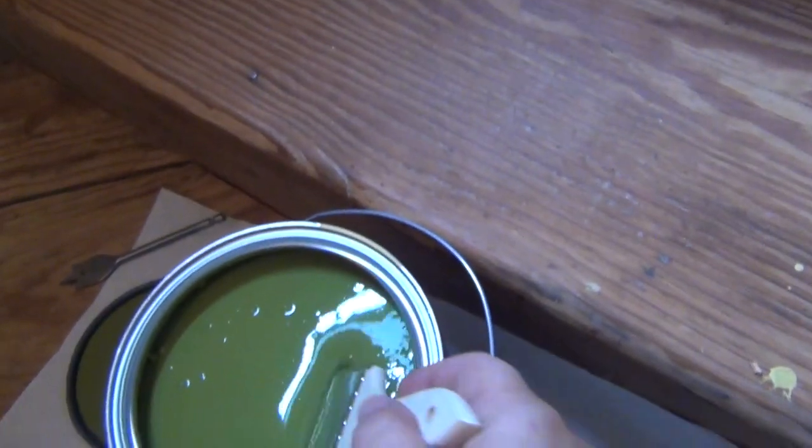The brush is not that great — I think I have to go clean my other brush. I'm definitely going to have to do several coats of this; for some reason it doesn't appear to have primer in it, so I might have to do two or three coats. I'm doing all of the corners first, doing them twice — looks like three times. I always do the corners several times first so they're done and I just have to do the rollers. It's easier for me instead of alternating corner and roller coats. I don't know if that's the professional way but it works for me.